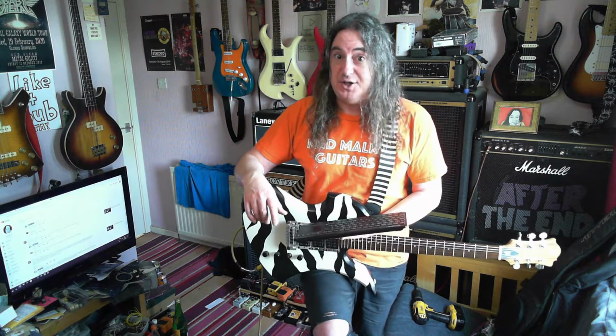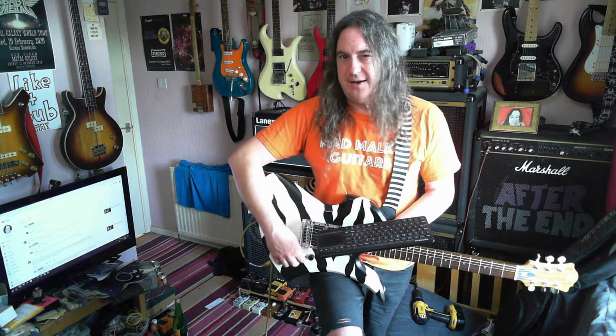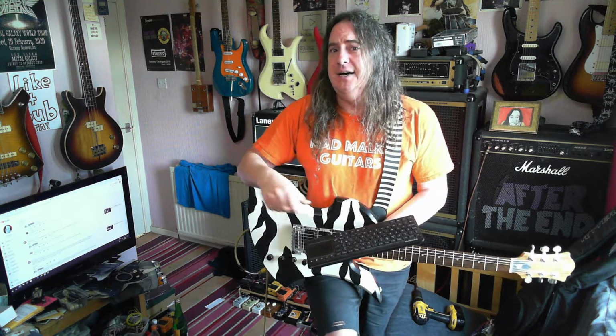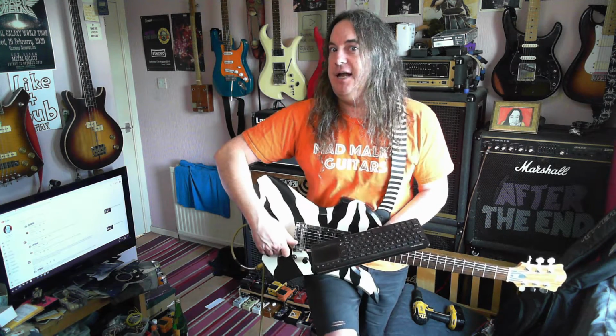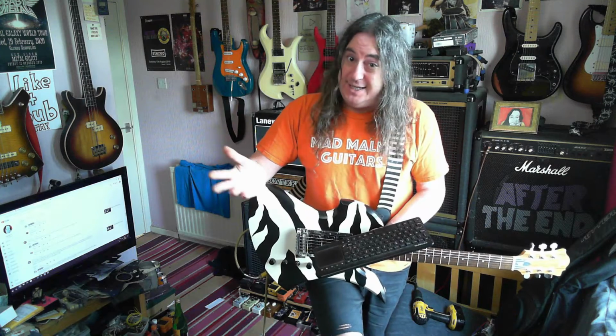I can basically put a phase switch in any guitar that's got more than one pickup. It's really useful in a Les Paul or an SG where you've got two volume controls. When you've got two humbuckers, you've got your rock fat humbuckery sounds. The phase switch, especially if you've got a volume control for each one, lets you have it fully out of phase, or you can roll one of them down and it's less phasey, and you end up with more acousticy, more single coily type sounds.